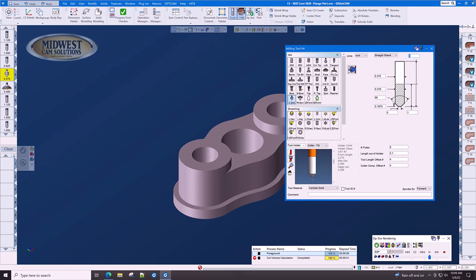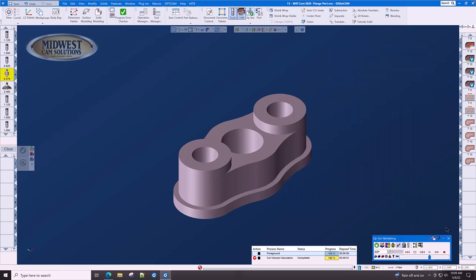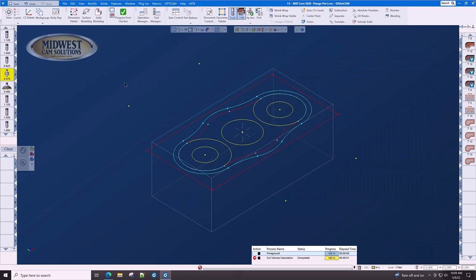If we zoom in here, we see that the countersink has a sharp point, and it has an included angle of 90, which makes each side 45, and the diameter is 3/8. It will have 4, 5, or 6 flutes, and it has 3/16 worth of usable flute. We need to remember that as we move forward in this lesson.